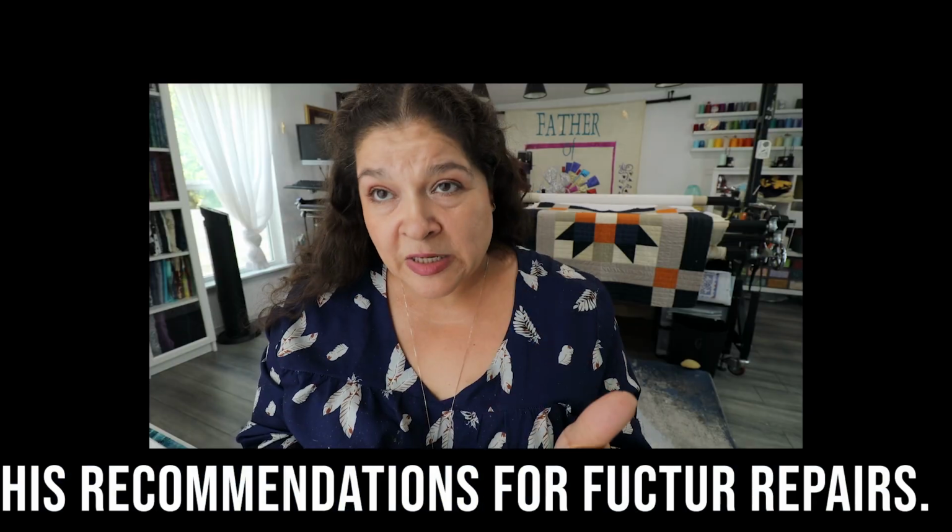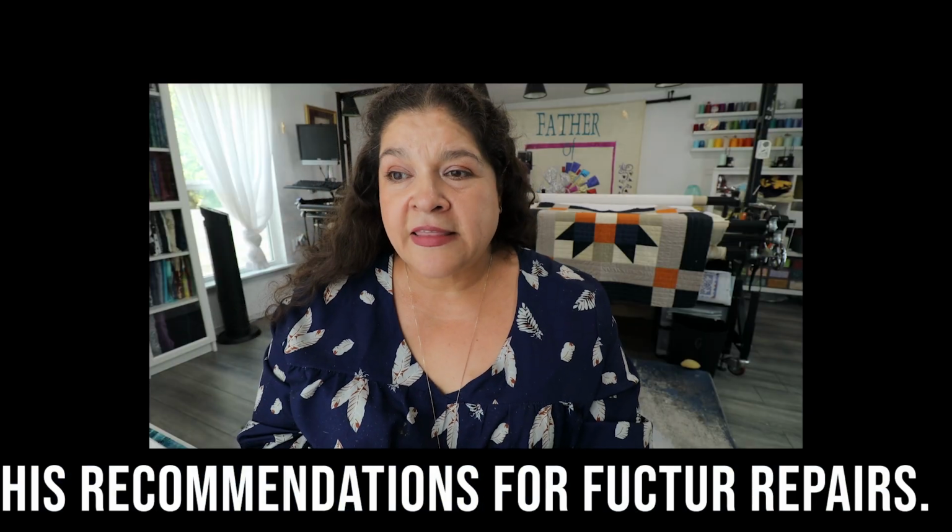So, amen. What else did he recommend repairing? I think I need to get a power surge supply for the back computer, and he also recommended getting the umbilical cords. I call them the umbilical cords. For my Gammill, he says they should be replaced every 10 years. My machine's 14 years old. He suggested upgrading the computer down the line, and I asked him about the stitch regulator sensors, and he says as long as they're working, he didn't recommend replacing them.